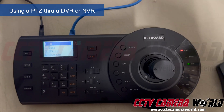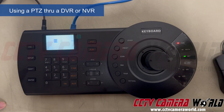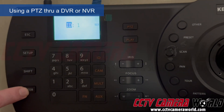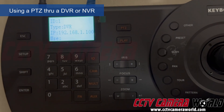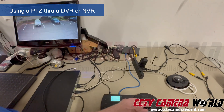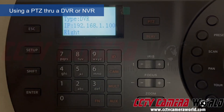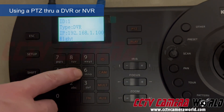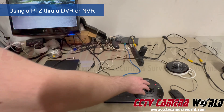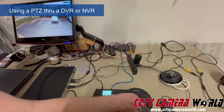Let me show you one more time from the beginning. Press Enter, then type in the ID of the device — ID 1 for our DVR — and hit Enter. When it connects successfully it gives you a confirmation message. If you flick the joystick around, it just cycles through channels — we only have one camera on channel 5, so other channels show no video. To control the PTZ, enter the channel number — 5 in this case — then click PTZ. Now it connects and moving the joystick controls that camera.